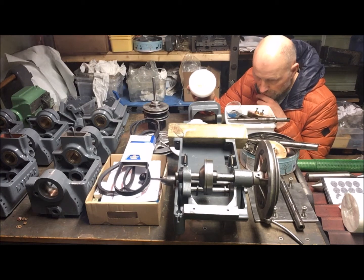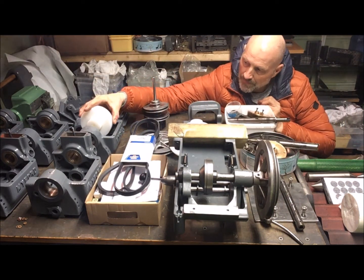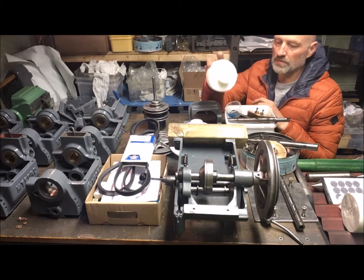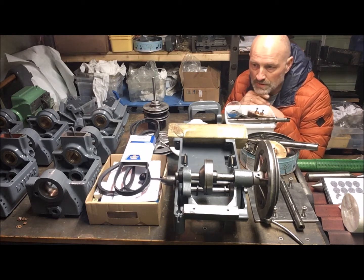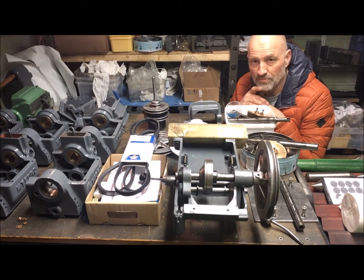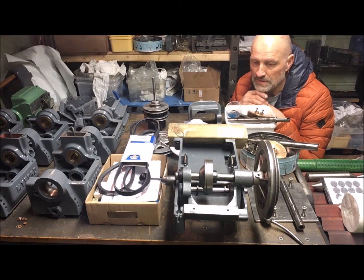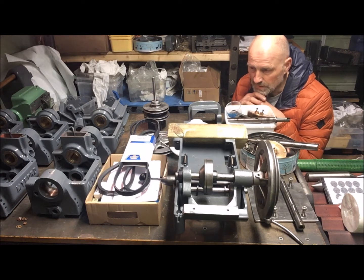With a multi-rib V-belt you can make your own pulleys, as I will do on two machines. With the three-step pulley inside the headstock and on the motor, you will cover the range. If you have a 1400 RPM motor with a double reduction, then a one-to-one, and then a 1.2 or 1.5 increase in speed, you will actually have a complete range up to 3000 RPM — and this is with the VFD, so you don't really need all that.